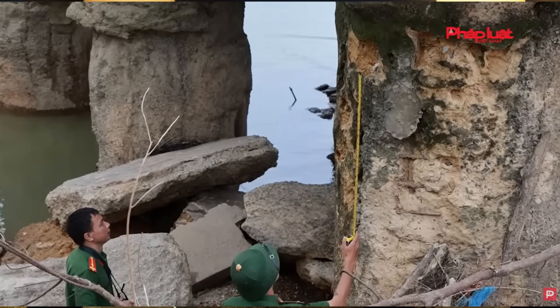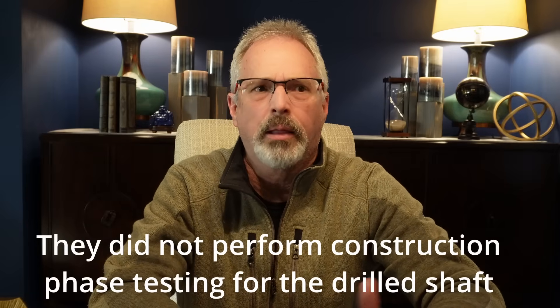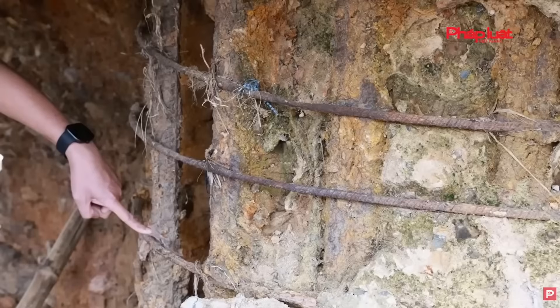You would have thought they could have seen the tops of the foundations before tying them into the cap, but that's not always the case. I once had a project where somebody brought me in as a consultant — they had a very poor quality drilled shaft at an electrical substation with a very nice looking troweled exterior, but once equipment got into the side, it started crumbling and turned out to be very weak concrete, just like these shafts. One thing that would prevent continuing to put a bridge over a problem like this is construction phase integrity testing. It looks like that may not have been done here, even though I would have expected it back in 2010 to 2015.